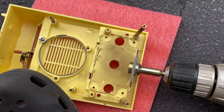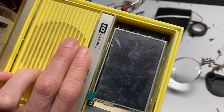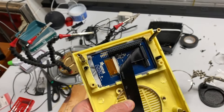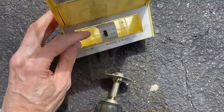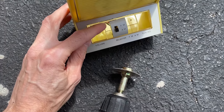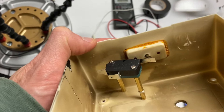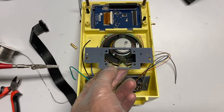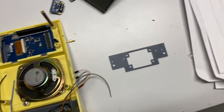After removing the clock face, I had to cut out a space for the display. I 3D printed a bracket to hold the display in place. You can see the ribbon cable that connects to the GPIO pass-through pins. Unfortunately, I could not reuse the bottom controls, so I had to cut them out too. It was important to reuse the mechanical snooze button at the top. I fashioned a clicky game switch on standoffs to fit perfectly under the button.